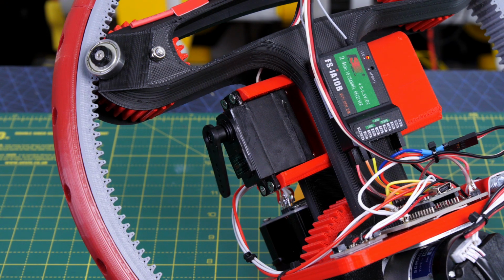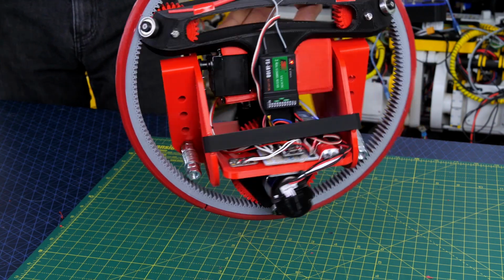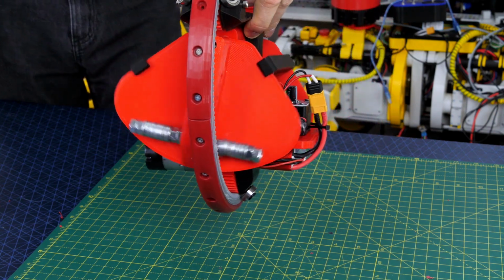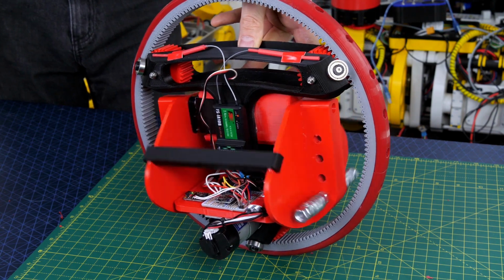So it looks like it's time to add some steering. I've added an additional radio control servo here, which is going to move some ballast left to right. And that looks like this. There's a big 3D printed assembly with plenty more space to attach some more ballast, but for now I've got 2 bits of M8 studding and lots of washers and nuts lined up there to add some mass, and I've tried to keep that as low as I can.